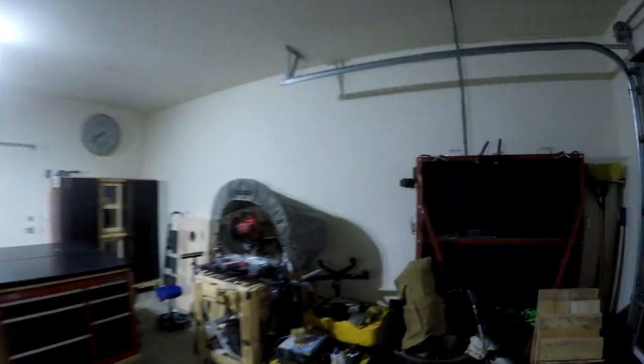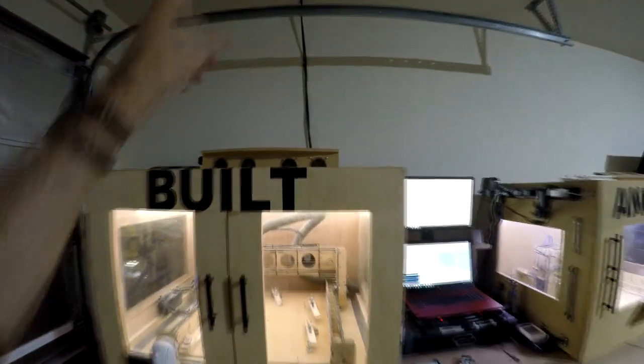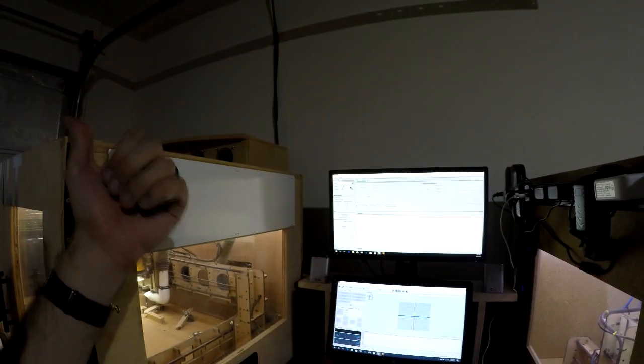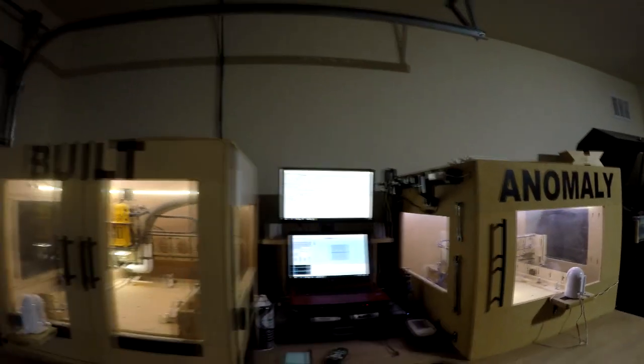And then to specify on that, I had wired in three dedicated circuits to this garage. These are something I just did really fast, because the outlet panel is right on the other side of that wall, so it's super easy just to come through. And there's 2 temporary extension cords going up to the ceiling. So I have one extension cord just powering this bar and then the other CNC's bar. These are all light duty, like LED lights, camera. The only thing heavy duty on this is the router that draws a lot of amps. So having that isolated is going to give me no issues.